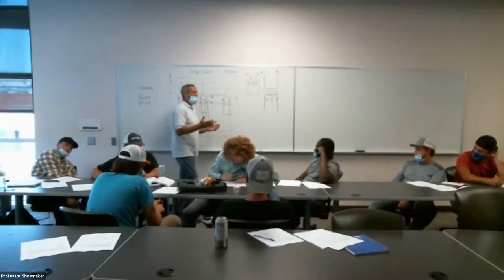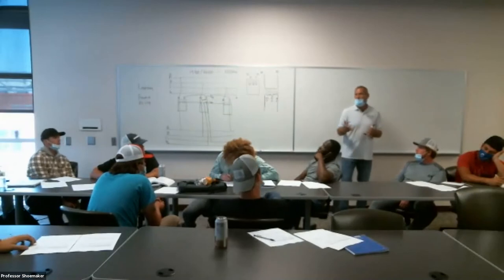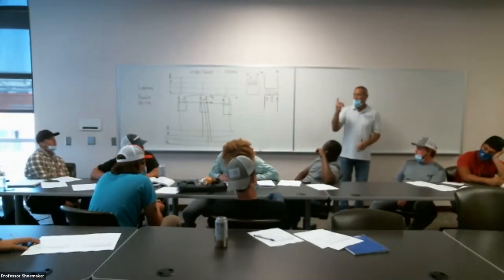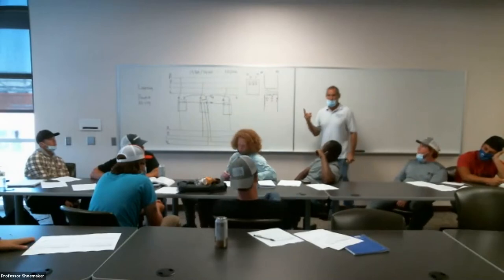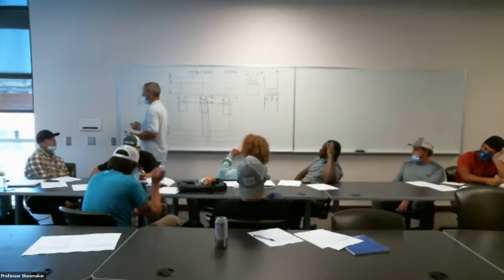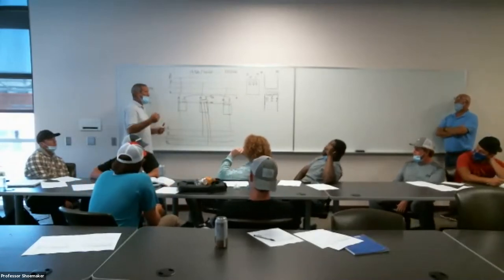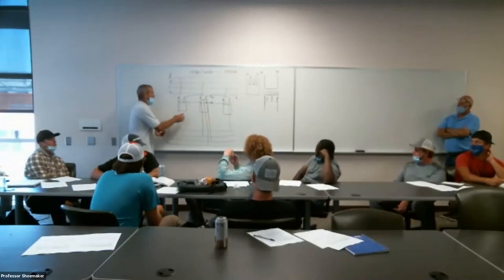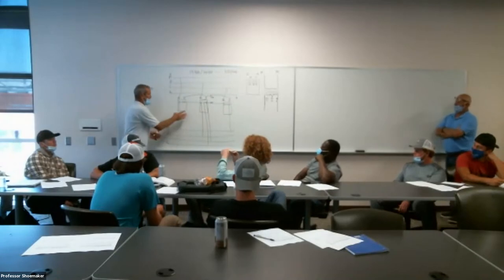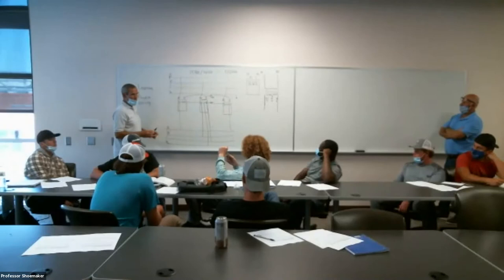How about open delta? Why do I go to open delta? More lighting, less motors. Right, they've got more single phase, like air conditioning. Why do I use closed delta? Because you've got more three-phase. I'm at Canfor over there, they're running motors and saws out of the plant, so I need more three-phase and some single phase. That's why we're actually using two transformers to get that third phase right there.